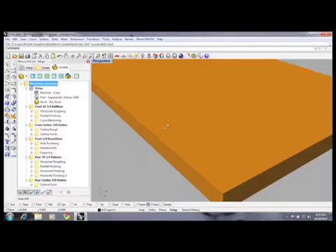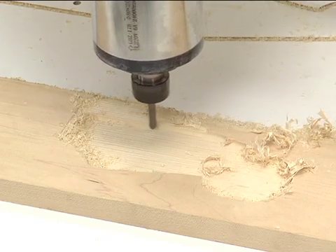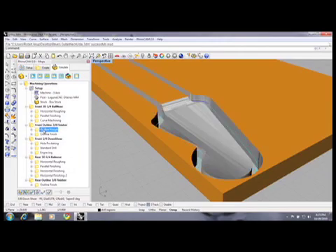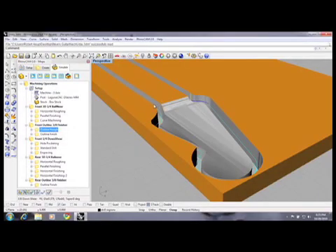First thing I wanted to do was create the headstock area — this is the 3D surface I mentioned. It's got some contours, so we did this in a number of different passes: first we rough it out, then we get a little closer, then a final cut so we get a really smooth transition. We don't want to have to do any secondary operations on it. That first operation was done with a quarter-inch ball nose tool. Then we went to do the outline — cutting the outline of the neck itself, but leaving it about 30 thousandths fat, because when we flip it over we'll clean that up with a finish cut. An exception is the headstock tip, which will be unsupported when flipped, so that area is done to final size.